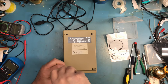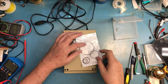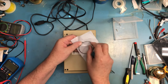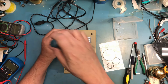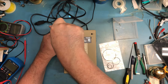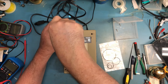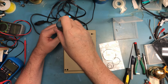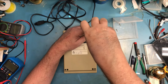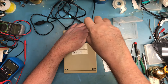I saw one video that basically implied that the main drive belt, the big one, because it had been on the drive motor for so long, was kinked. And even though it was continuous, that kink in it was enough to create enough flutter on the playback that it couldn't actually load a program off a tape. And that by just replacing that one belt, the unit was able to work. It also implied that it wouldn't fast forward or rewind.